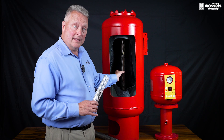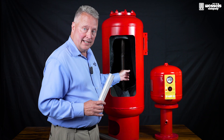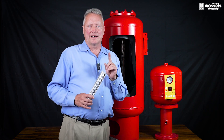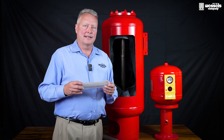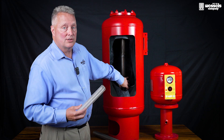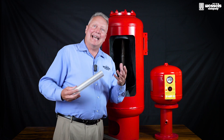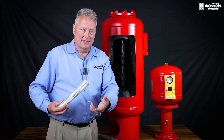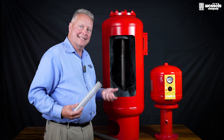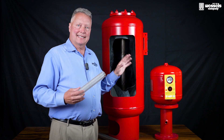So we've got the antimicrobial aspect of the waterway plus the churning of the water, and then we have one more thing we can do. The recirculation line going from the water heater out to the furthest fixture can be brought back to the TT-RX, and that recirculation line can continue to move water through this vessel. As it does that, it adds the temperature of that recirculation line — maybe 135 to 140 degrees — coming back through the expansion tank, which would further kill anything inside.